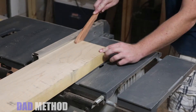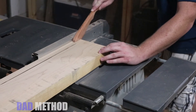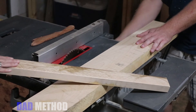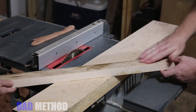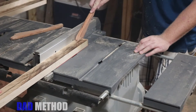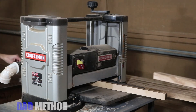Since the hunk of maple we're using is so thick, we decided to cut it in two passes. I didn't know it at the time, but the burn you see on the wood is caused because the blade wasn't sharp enough. If you're gonna cut wood with the table saw, make sure you've got a good sharp blade. One more cut to give us one and one-sixteenth inch square rods, then one more trip to the planer to clean off the burn marks before we start sanding.